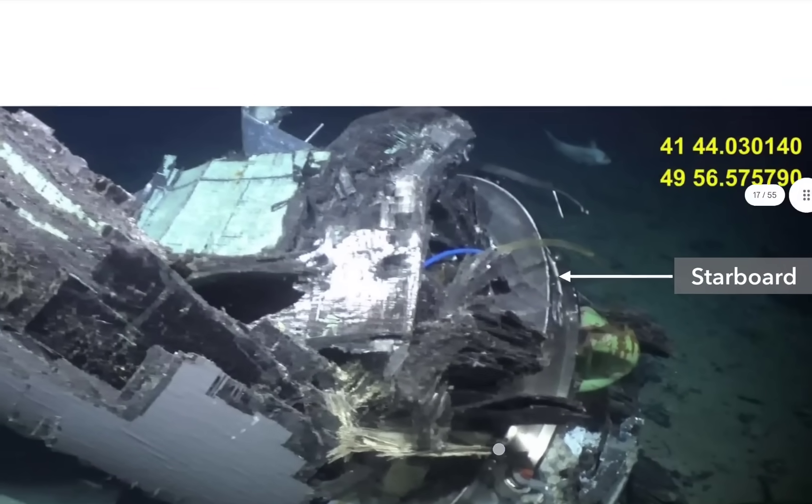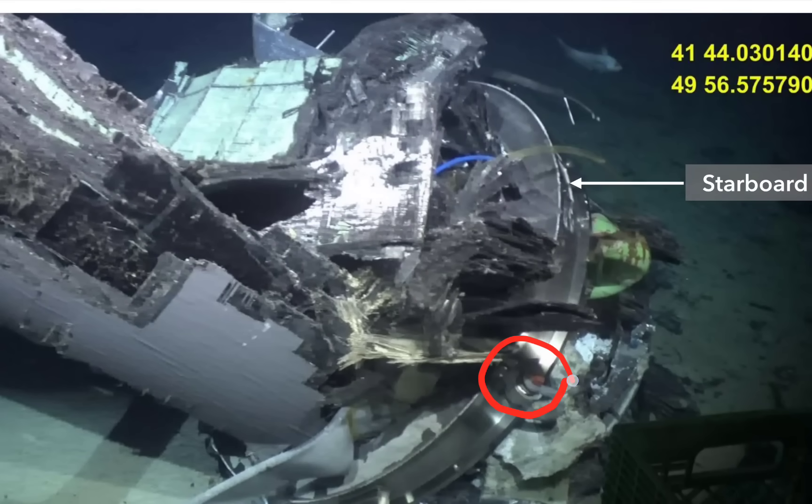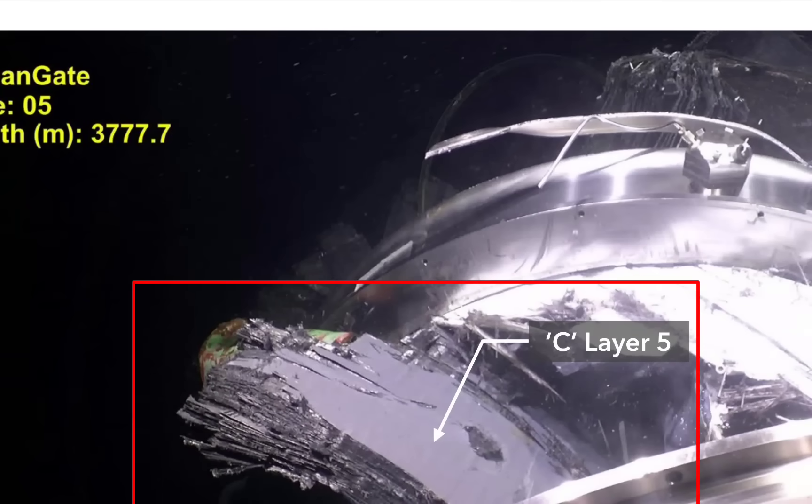Here's another angle. This is your orientation — there's a shackle up top, see the red, and this is where the bracket was welded on. This is why I keep saying, with further evidence and data, that the back end fell off. It didn't implode and hit the batteries and push this off — including breaking the weld. The three bolts they used held up and it ripped those things apart, but that's not logical. So we've got a weld failure here.